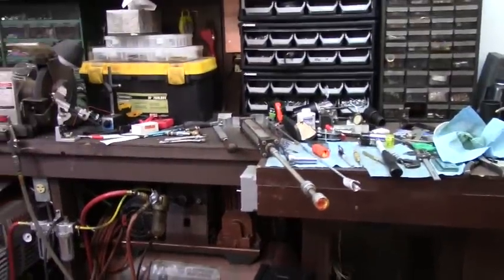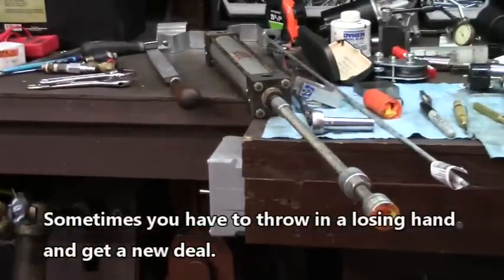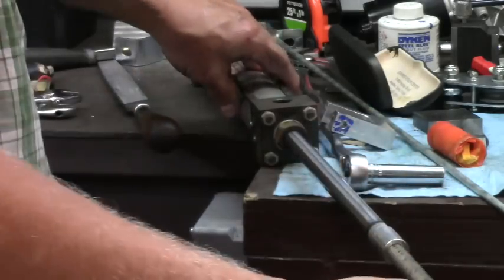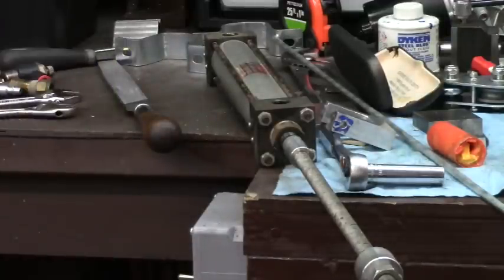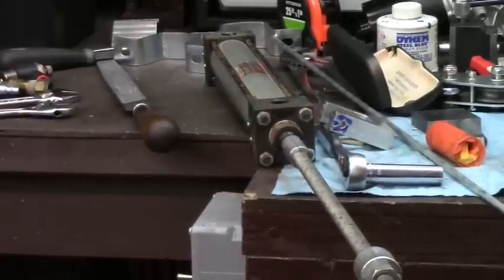Okay, I looked over the idea with the lever and all that, and I didn't like it, so I decided to go high tech. We're gonna push the plastic in with this air cylinder. It's not a hydraulic, it's air. And we're gonna use him to shove the plastic in. There you are. All I gotta do is bolt it down, you know, above the cylinder, and then plumb the thing right to get the air into the right ends at the right time. So we'll just keep on in this direction.